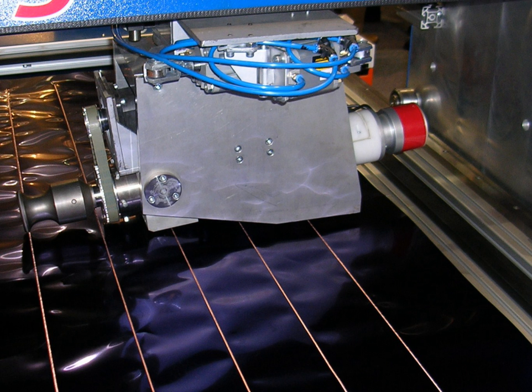Aluminum is a difficult metal to weld using traditional techniques because of its high thermal conductivity. However, it is one of the easier materials to weld using ultrasonic welding because it is a softer metal and thus a solid state weld is simple to achieve. Since aluminum is so widely used in the aerospace industry, it follows that ultrasonic welding is an important manufacturing process. Also, with the advent of new composite materials, ultrasonic welding is becoming even more prevalent. It has been used in the bonding of the popular composite material carbon fiber, and numerous studies have been done to find the optimum parameters that will produce quality welds for this material.